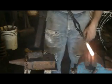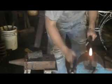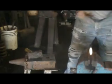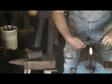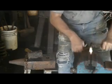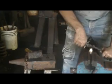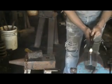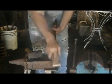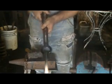The next thing is to twist a piece of metal. So here's a piece of metal. We're going to put it in the vise. I always like to put mine in horizontally, because what that does is it allows me to keep an eye on what I'm working on. And with a twisting wrench, bring it around. You decide how many turns you want it to be. Wire brush the scale off of it. So that's a basic twist.